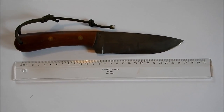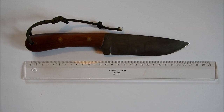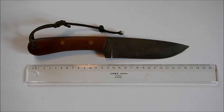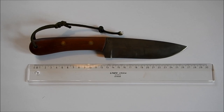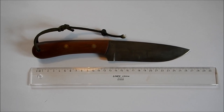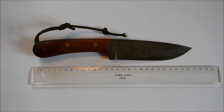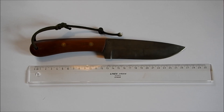So let's look at this knife and its shape in more detail — for that we're going to have to go inside. Some stats about this blade: it's got 27 centimeters total length, the blade length is 14 centimeters. It weighs about 280 grams, which makes it about the same weight as a military Kabar or a Loiku. Most hunting knives are in the 200-gram range, and a Mora Black — which is a heavy-duty Mora — is about 113 grams. The width of the blade is about 3 millimeters, the same as a Loiku or a military Kabar or most hunting knives.